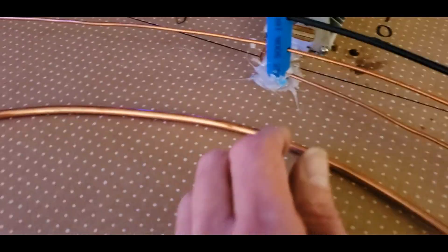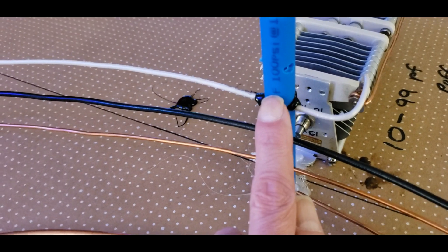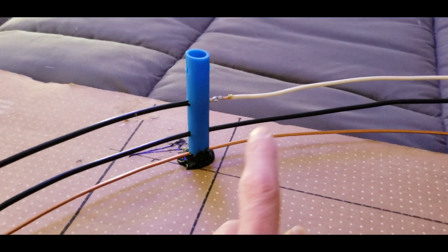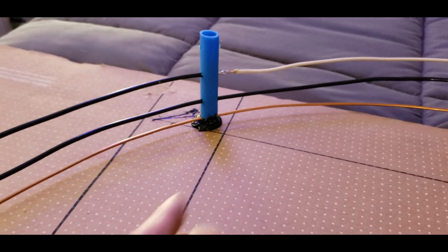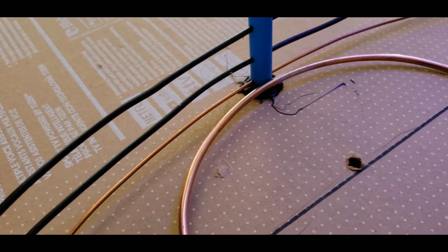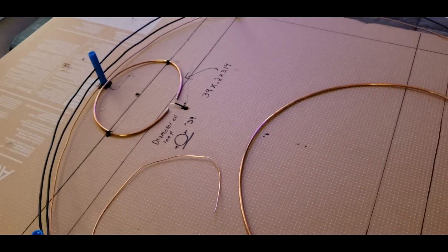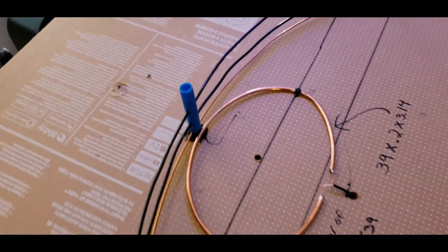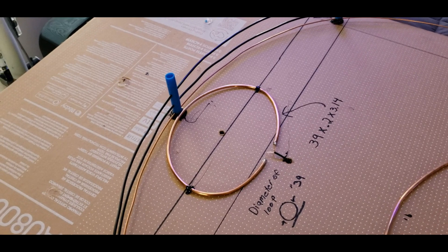You can see the transition right here — it starts here, works its way up to the next wrap and the next. I soldered two 13-foot scrap pieces together to make a longer length. By testing I found that flipping the coupler loop to the outside didn't couple as well and lost performance on the band. So inside is where you want it.